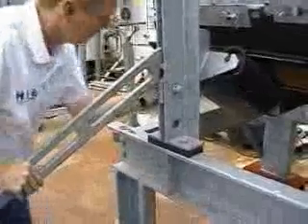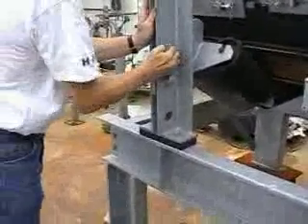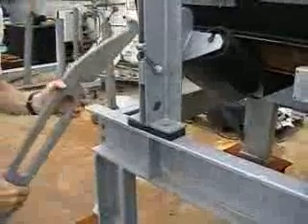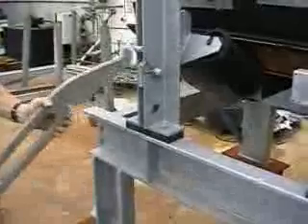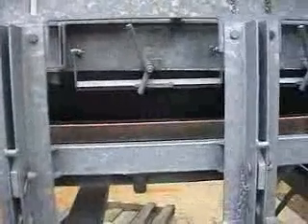Once you've replaced the rollers and put them back in place, all you need to do then is raise the actual height of the idler, put that back in place, remove the operating tool, and then put the pin in place — which is done in a matter of minutes. You just knock that in with the actual operating tool and make sure it's knocked in place. And that's our drop-down idler. As you can see, that's another option for you to look at. But first and foremost, the easy maintenance skirt clamping system and liner-adjusting system is what we like you to consider. Thank you very much.